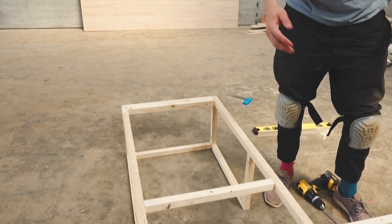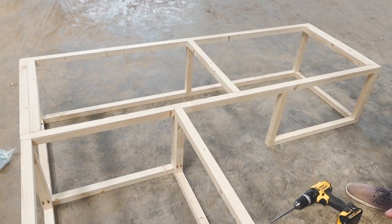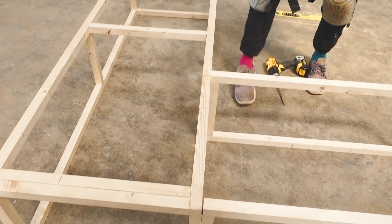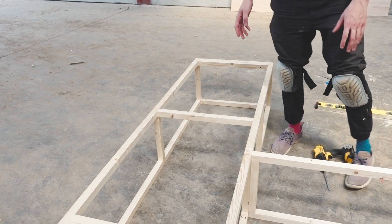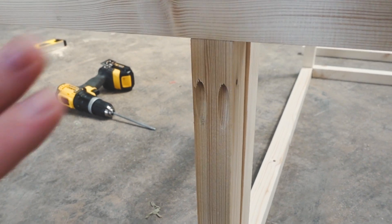It's an L-shaped bench done in two parts — a straight bit and another straight bit that we'll join inside the van. There's a gap here where we'll have some runners so our toilet can slide out. There's also a cat flap here and Gingi's litter tray, so both toilets together — hopefully not too many smells! All of this is storage with lift-up 12mm ply on the top surface. I've been pocket holing every single join so it's super secure and looks really nice.